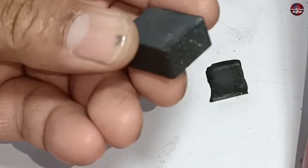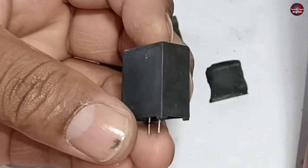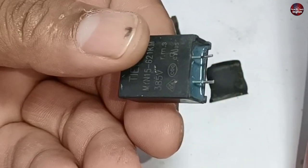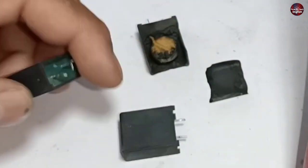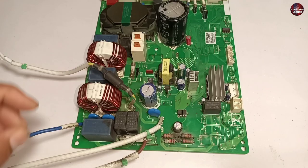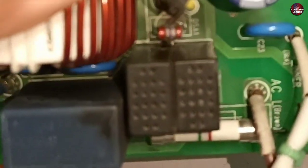This physically good-looking ZNR is completely bad. If installed again in the motherboard, it will make a short circuit. The first ZNR has a chance to be good, but this second one has no chance. I have now changed all the damaged parts in this motherboard — the fuse and the ZNRs.